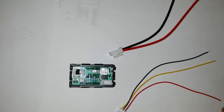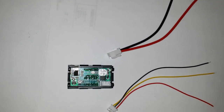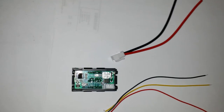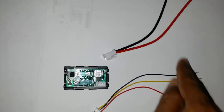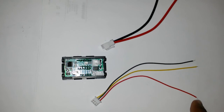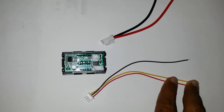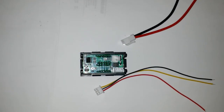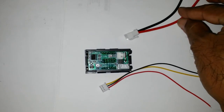We need power for the device, so we have to connect this to the positive side. And then we have voltage sensing, and this could go in different positions, but if we connect it straight up to the positive, it will check the voltage at that position in the power supply. I suspect again this can be put in a different position, in which case it will check the voltage relative to this ground, which is the same as this ground, at that position in a circuit, wherever it may be. It does not necessarily need to be where this is, but if this and this are joined, what we're going to get is the voltage from the power source, ground, and current that goes through on this side. And I think that's why it makes sense how it's wired. But without that explanation, it's counterintuitive for this red wire to go to ground on the load.